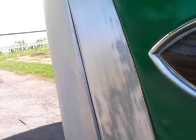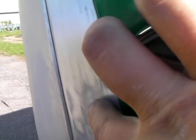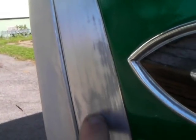One more thing before I forget: when you're sanding it down, you want to get all of the shiny spots off. You want it to be all dull, like it is right here. Because if you have shiny spots, it's not going to buff out right. You've got to get all this stuff off, get it down to just dull aluminum, and then it'll polish right up from there.